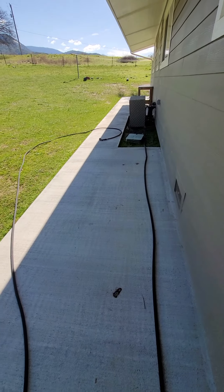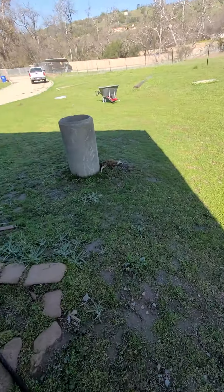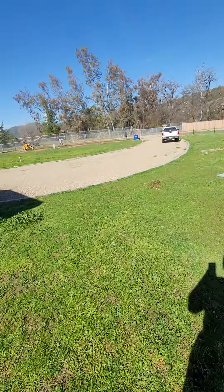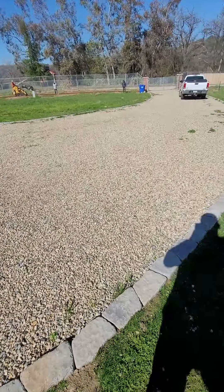The concrete finish is okay — a little rough — but he missed expansion joints entirely: no joints. Anyhow, there's my customer Myron over there, a very concerned customer with a lot of questions, which is good. I'm going to show him and tell him exactly how these jobs should be done. I'll get back to you guys with the update.